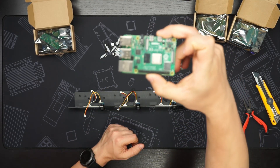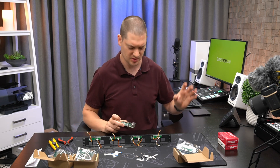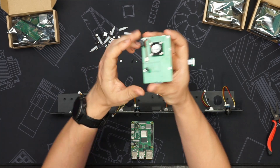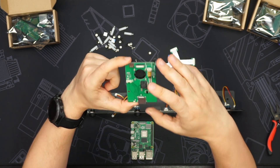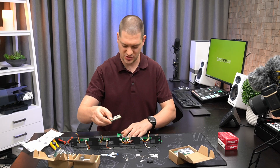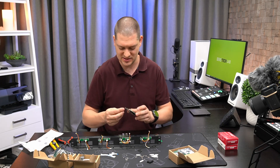I've got a standard Raspberry Pi 4B here and I'm going to put three of them in right now — one is already in use as my companion Pi from the previous video. The PoE hats have a couple of connectors that sit on the Raspberry Pi, plus a nice little fan to help keep it cool. This kit comes with stick-on heat sinks for the main processor. The instructions say to put on the PoE hat with standoffs — female side facing down to the Raspberry Pi and the male side sticking through the PoE hat.